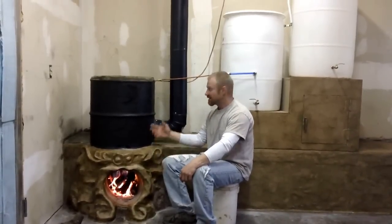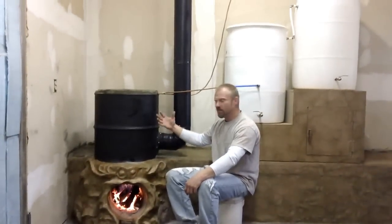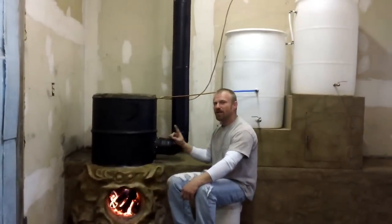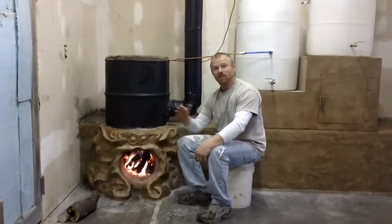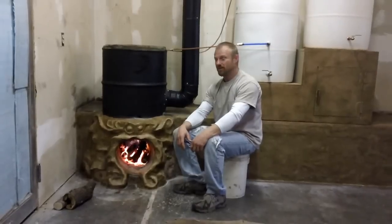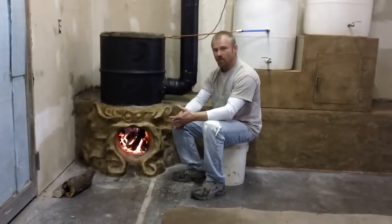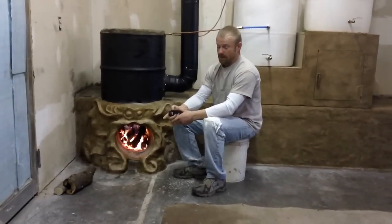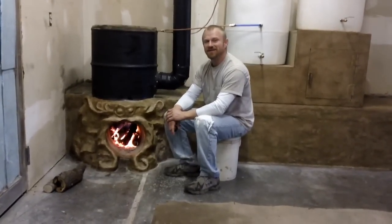I think what's happening is that brick riser is heating up, and as it heats up, even when the fire goes out and gets down to ashes, because the brick riser is still warm it continues to pull the draw up. Now, it is going to be important to put something over the front of this opening when the fire's completely out, so we don't get that cold draft in here. But I'm telling you, side-by-side comparison — what is easier, what burns better — I say it looks better. You guys be the judge for yourselves.